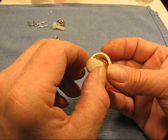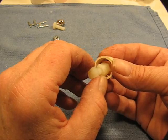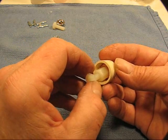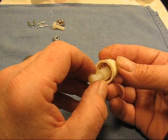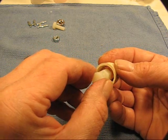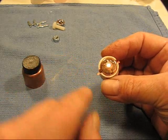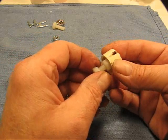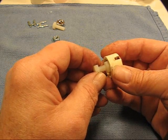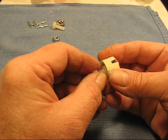The copper cap notch is wider than the coupling notches so there won't be electrical contact as you're moving the plunger. For the plunger, I've taken a plastic bolt — I'm using a bolt here so I can see what I've done. I have a plastic bolt and a couple of plastic nuts epoxied together, and at the end I have a copper ring that will touch against the QTC material. That copper ring has two tabs on it — those tabs prevent the copper ring from twisting. So as you twist to compress, it just moves the thing up and down.